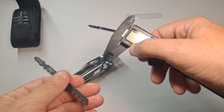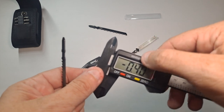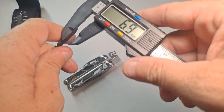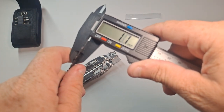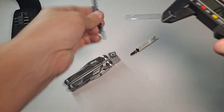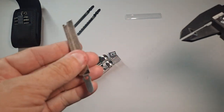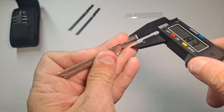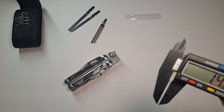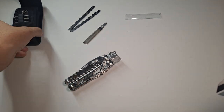With a digital caliper, the thickness of this blade at the T-Shank is one millimeter, and they're both one millimeter thick. The file that comes with it is also one millimeter thick. Why is that important? Unfortunately, on the packages they don't explain that if you get aftermarket blades, there are different dimensions.